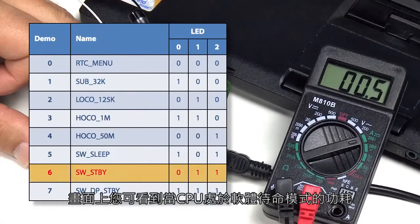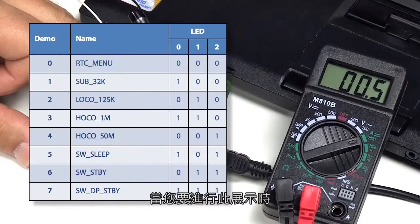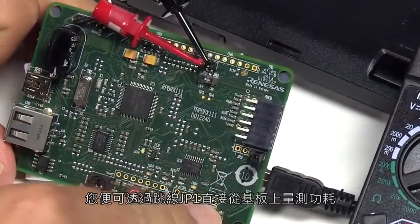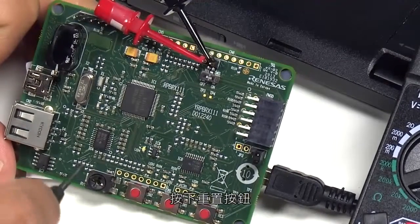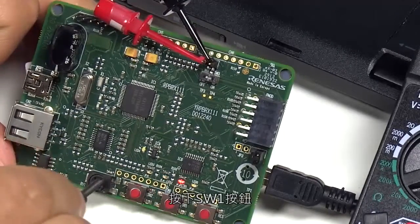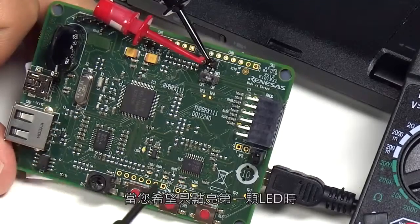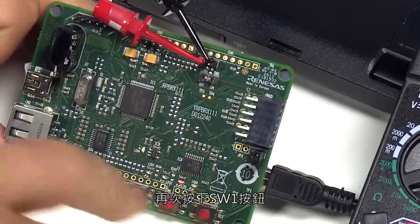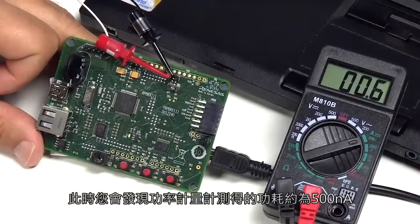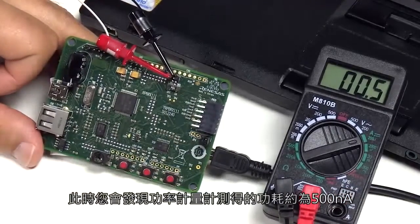Here we can see power consumption when the CPU is in Software Standby. In order for you to build and run this demo, you need to open e2 studio and compile and run the low-power code. Follow the instructions in the description file and you will be able to measure the power consumption directly from the board through the jumper JP1. Here we push the reset button, then you move the potentiometer so as to illuminate the first two LEDs, you push the SW1 button, then you want to illuminate only the first LED, you push the SW1 button one more time, and at this point you'll see that the power meter will measure power consumption in the range of 500 nanoamps.